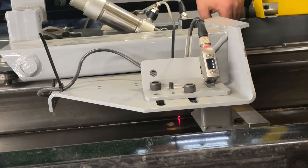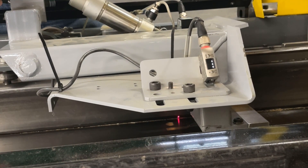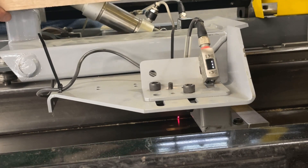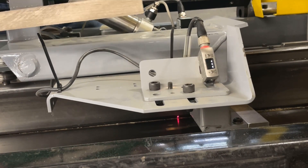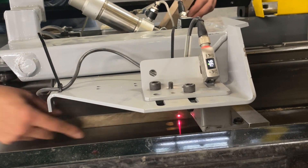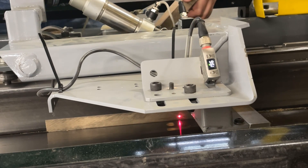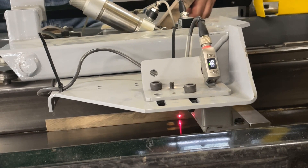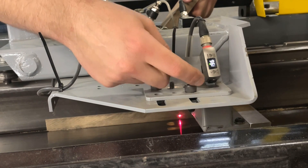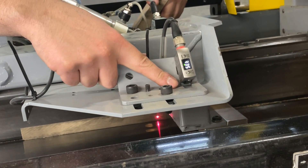To set its threshold, you will need a 1/8" to 3/16" strip of lumber and a 7/8" or 1" square piece of lumber. Start by putting the thin strip of lumber right on the fence against the table — this raises the background so it has less sensitivity to dust or other things that may settle against the fence. With that in place, hit the set button — just tap it once. This is the button right on the side of the sensor.